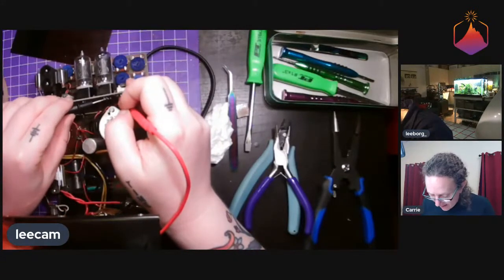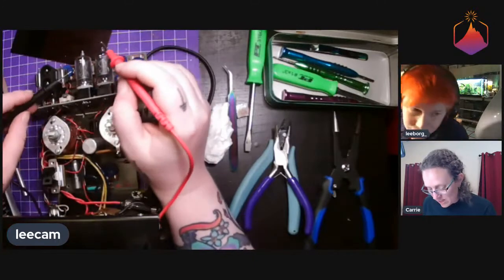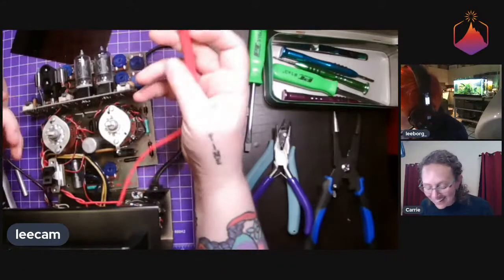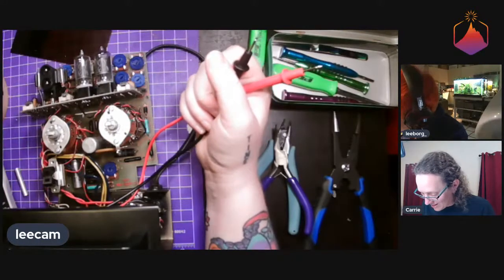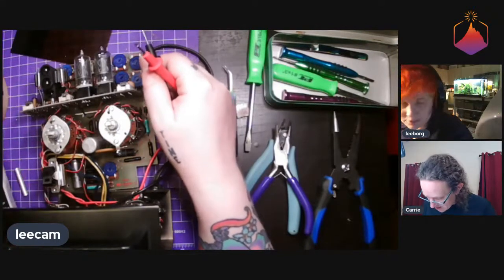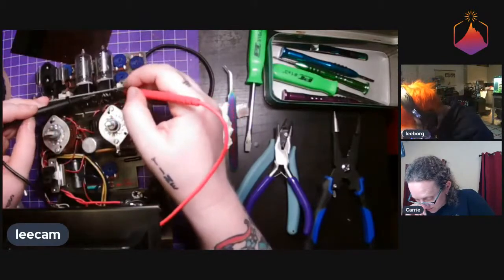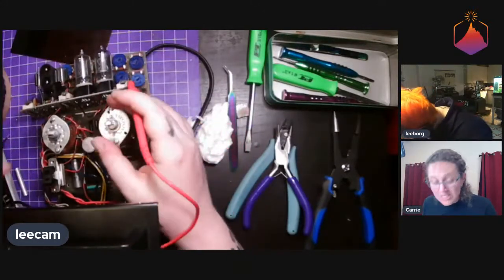Cool. So yeah, there's this whole section on waveforms and test point D16 anode and what your oscilloscope setting should be on and what the waveform should look like. Oh, wow. Possible cause of improper waveform: the diode or no voltage from transformer. And I guess there are only 6 things. Well, I sure hope it's one of those. That's pretty cool that there's so much detailed information on troubleshooting.